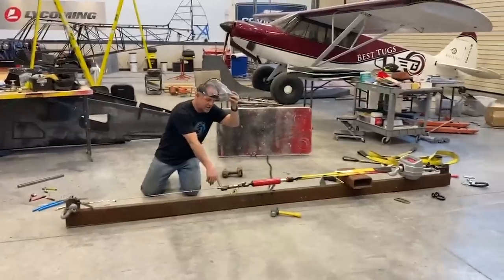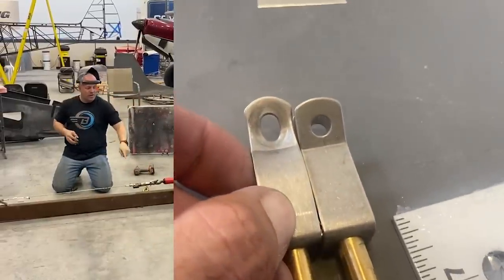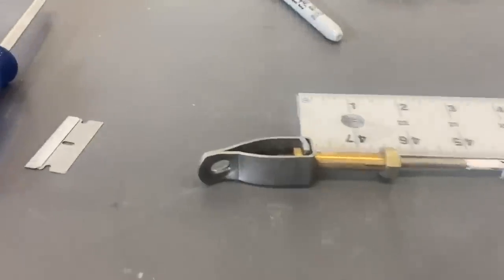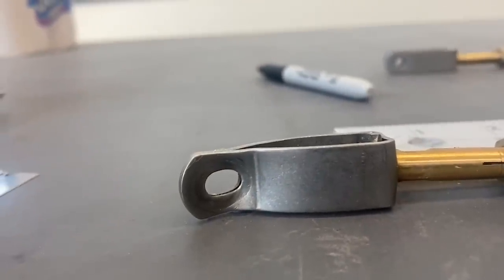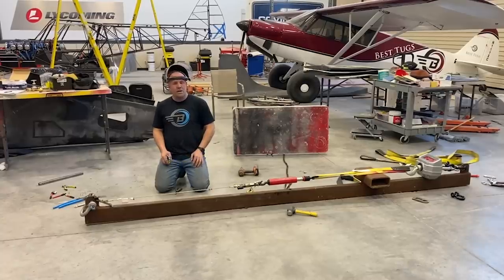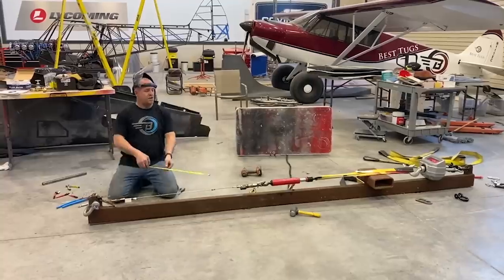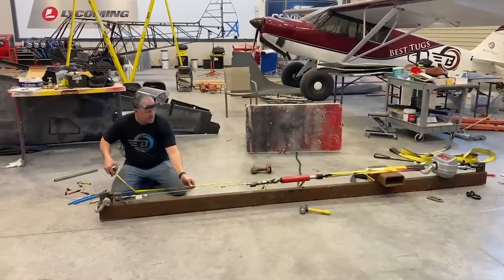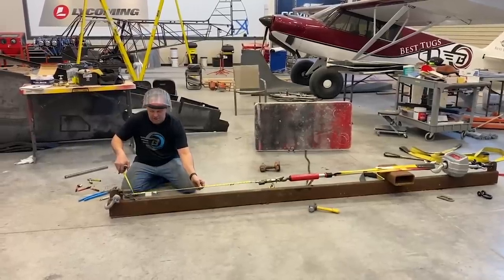This is now stretching through the bolt. So the bolt hole that this is going through is now elongated. I can see a hole coming out of the side of it. So I have stretched this part right here, probably a good quarter inch. Now when I'm measuring stretch of the bar, I'm measuring from that point, which has no indication of stretch on these components. It's just the bar that I've been stretching, measuring.